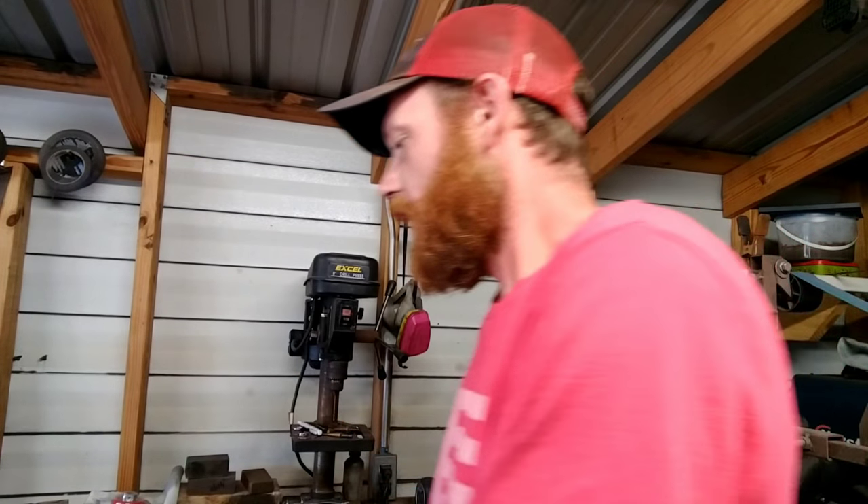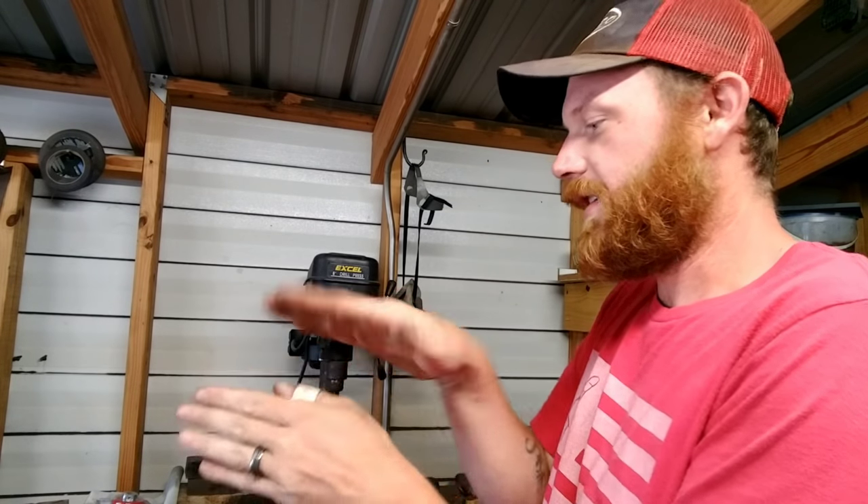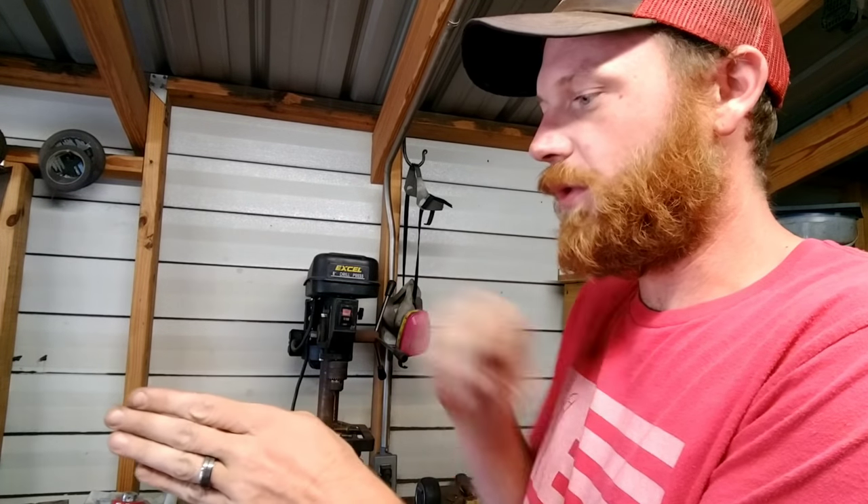Not quite a spring fuller. I've been doing some research on Viking swords, how they're made traditionally. One of the videos I saw of them making the Ulfbert — they did the crucible steel, the whole nine yards. But the way they did their fuller wasn't with a spring fuller like you'd think, which would be two pieces of round stock on a spring that smack together to make your fuller. It was a hardy tool with a guide on the side with the fuller, so you could ride your blade down the center and had a stop on the side every time — so you'd get an even fuller, flip it over, and do it again.